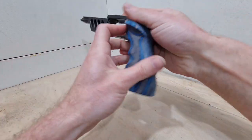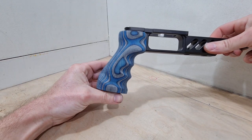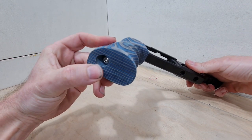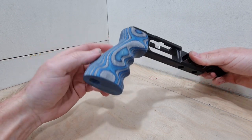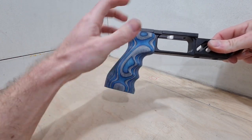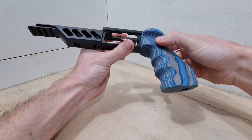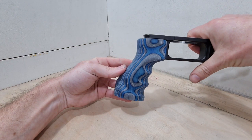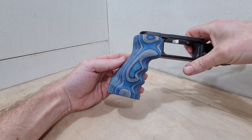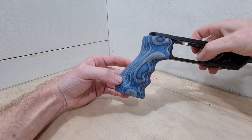That's turned out lovely — a nice little thumb shelf on the side of it keeps my palm relatively open. When it comes to sizing your grips up, it's always best to start on the slightly large side; it's a lot easier to remove wood than to stick it back on again. Always be mindful to keep well away from the fixing bolt and the counterbore in the underside when shaping. I like to do a little bit around the back edge first, start bringing it in, and then start encroaching on the finger grooves, then work around to the back edge. I'm going to go and test this before I finish it — fit it to one of my actions. If I need to make any fine-tuning adjustments I will before I oil it up. I'll probably do another video on oiling — see you in the next one.